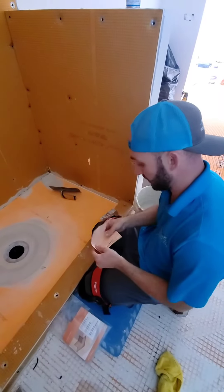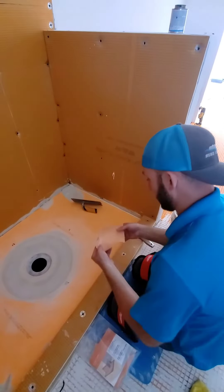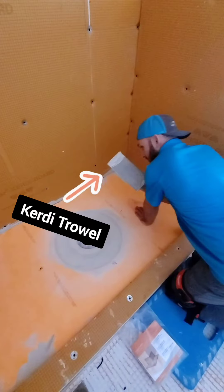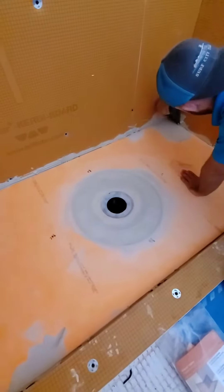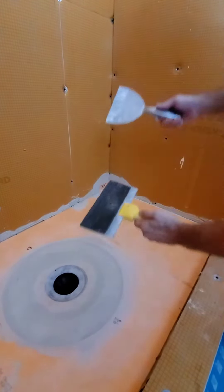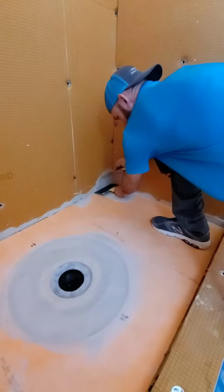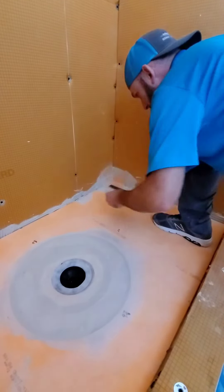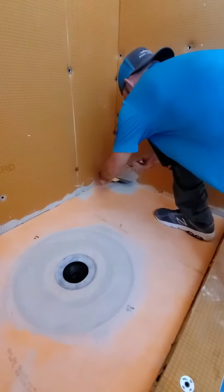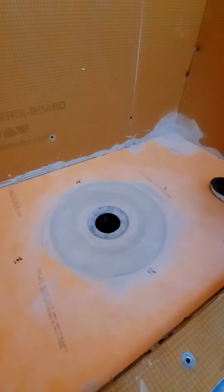Now I want to briefly go over how to install these corners — an inside corner and an outside corner. The inside corner is pretty straightforward. Take two of these guys, press one into the corner, screed with the other. I like to do it twice so that it coats it with thinset. I like to coat all my membrane with thinset. That is the successfully installed inside corner.